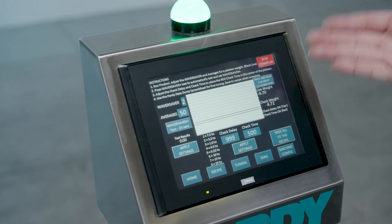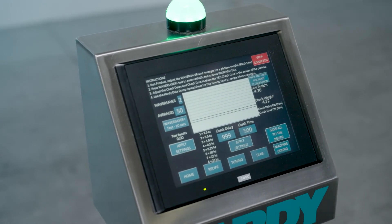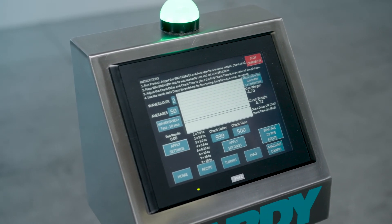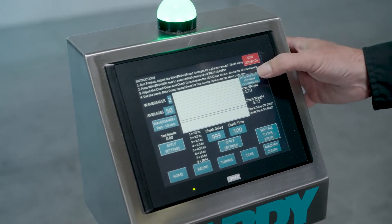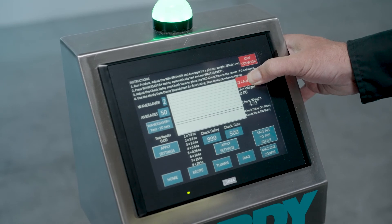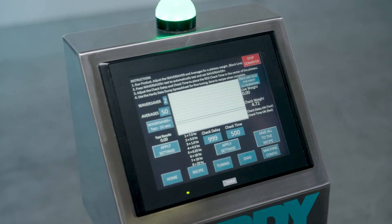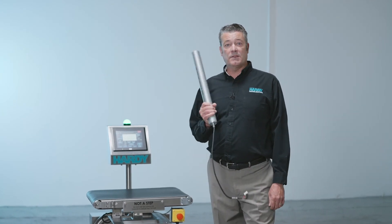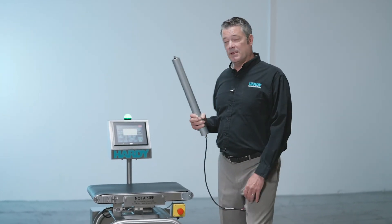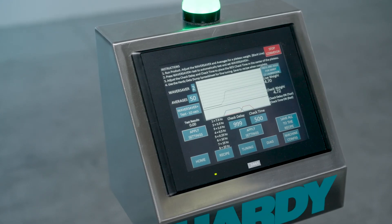I'm going to demonstrate that right now. You can see on this machine it currently shows a live weight of minus 4.7, because this machine is not calibrated. I'm going to simply press and hold C2 calibration. A few moments later, it's now showing a live weight of zero. Let me add some weight to the belt — I know this roller weighs 4.7 pounds because we weigh these regularly — and sure enough, it's right on the money.